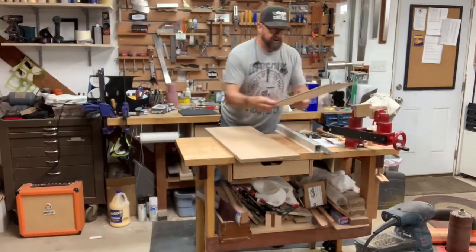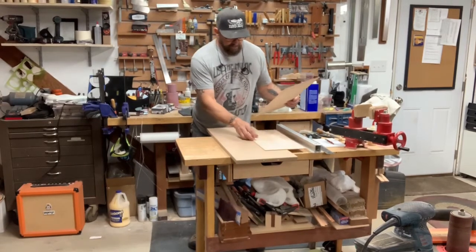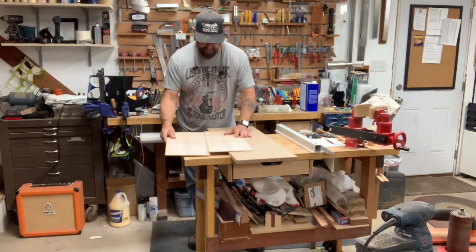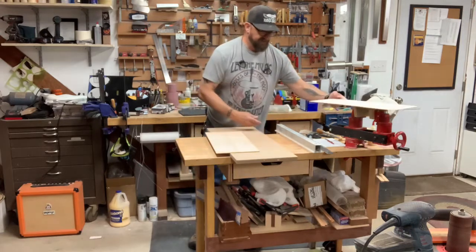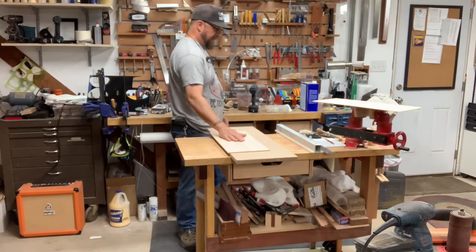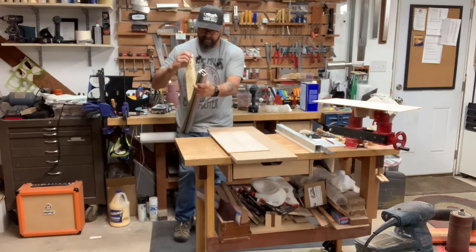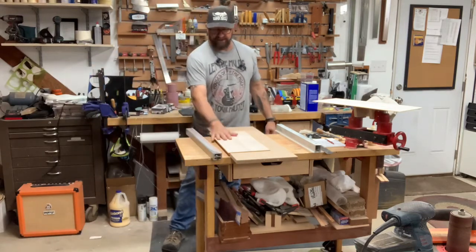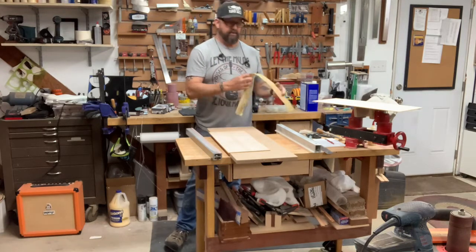Alright, sorry about that guys. Now, just to be sure I've got a good square joint here, I'm going to take this piece where I already did the whole thing across the sander. I've got to make sure I keep my pieces in the right order and not get confused. I'm just going to let it hang off the board I have on the table — just hanging out a little past the edge — and that'll keep it flat. I can run this across there and make sure everything stays square so I'm not inadvertently making the side of the joint wobble. Try and keep everything straight and square.